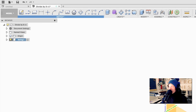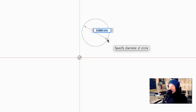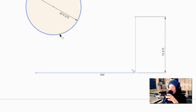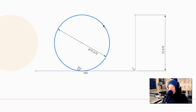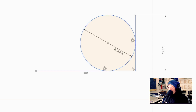Okay, create a sketch. Usually I start with putting a marble in. A circle 15.875 — that's the dimension of one marble. Put in a constraint; we're going to say that the marble is resting on this surface, so I can move it along that line. Let's also constrain it to the back of the wall.